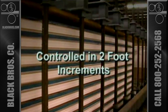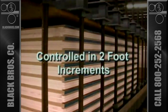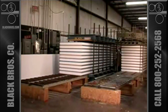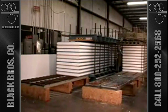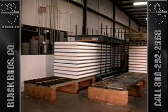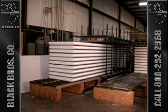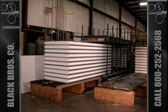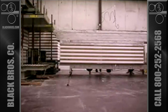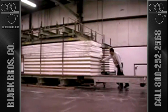It's controlled in 2 foot increments for panels over 8 feet long, and allows you the capability of loading and unloading one stack while another load remains under pressure. For example, you can laminate three 8 foot long stacks, two 12 foot long stacks, one 8 foot and one 12 foot stack, and so on, all the way up to full size 24 foot long panels, all in the same press. When pressing a load shorter than the press opening, it's normal to use EPS filler to make up the difference.